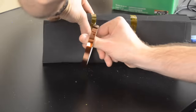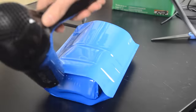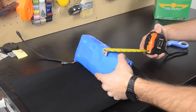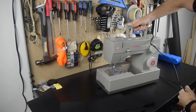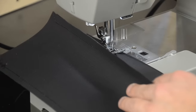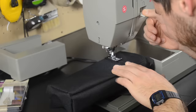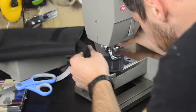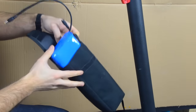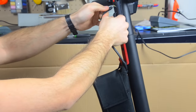Lastly, I'm going to add a bit of foam around the pack just to protect it, then slide the heat shrink around it and seal it off. You can use a heat gun for this, or you can just steal your wife's hair dryer like I did here. To hang the battery on the scooter, I'm going to make a simple bag for it. I'll make it like a box with four pieces of material for the sides, one more for the bottom, and a flap for the top with some velcro. I'll also sew a loop to hang on the scooter's handlebar hook, and another strap that will velcro around the scooter's stem. My sewing turned out decent, and I'm almost ready to plug in the battery.